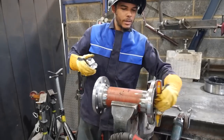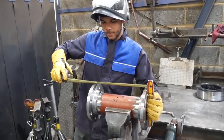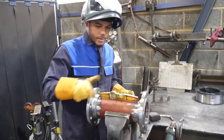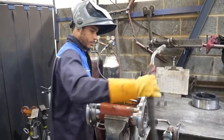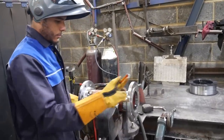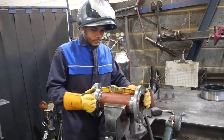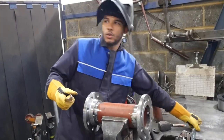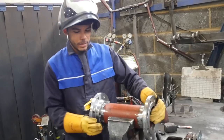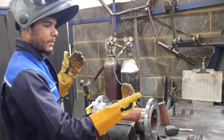Just going to double check and make sure the overall work is good. Now we can flip it 90 degrees and level it off the other way. It's not initially critical to have the bolt holes lined up perfectly to flip exactly 90 degrees, but the better you get it the more accurate your second leveling will be.